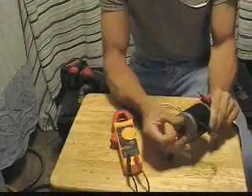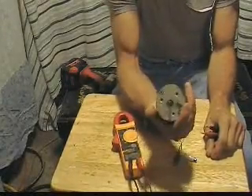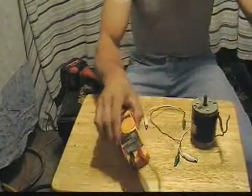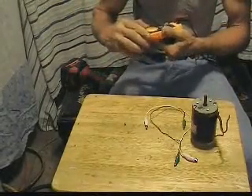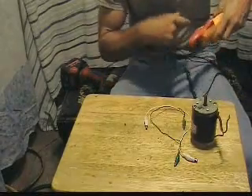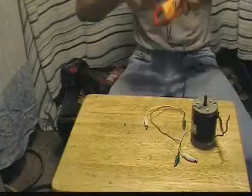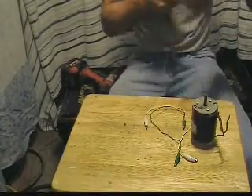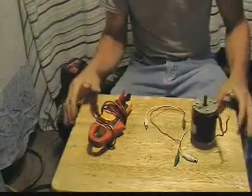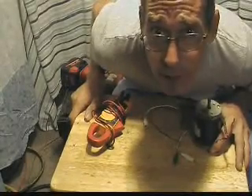You can play around with different DC motors and get different results. Typically, if it's a heavy motor like this with permanent magnets, those are the ones that are going to be efficient both ways — as a motor or a generator. You can take an AC motor out of a washing machine or a box fan, and you're not going to get much power the other way. They will put out voltage and it will be AC, but it's not going to be much — you'd have to really get some RPMs. DC motors are very efficient because of their magnet style, and the bigger and stronger the magnet, the more powerful your motor. Thanks, and please be nice with the comments.